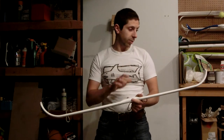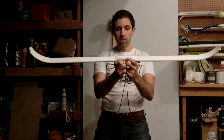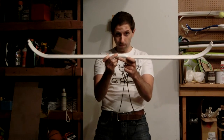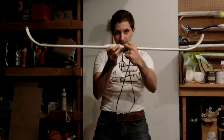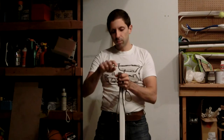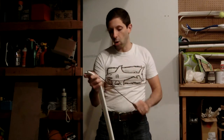Everything so far looks really, really good. I measured true center, measured two and a half inches on either side, and that's where the board started. From that point it tapers from the set depth all the way to basically nothing, as flat as it could reasonably get. The tips have simple pin nocks carved one half inch deep. We have a string here with adjustable loops — it'll be the same string on all of the bows.